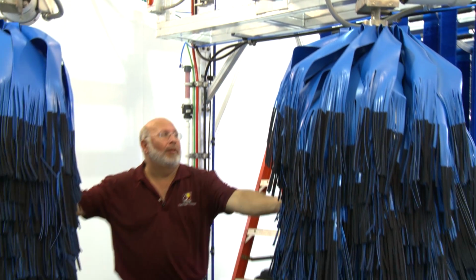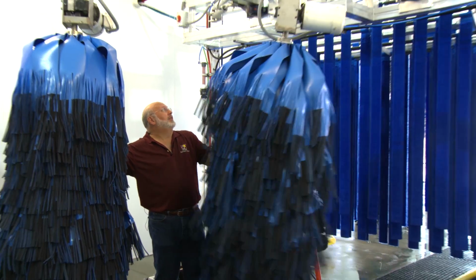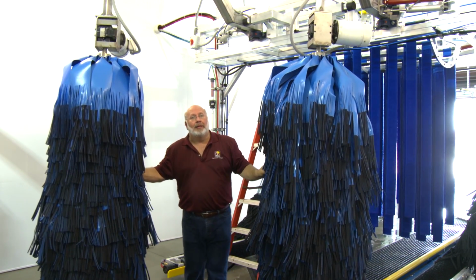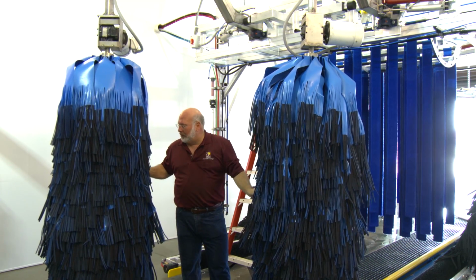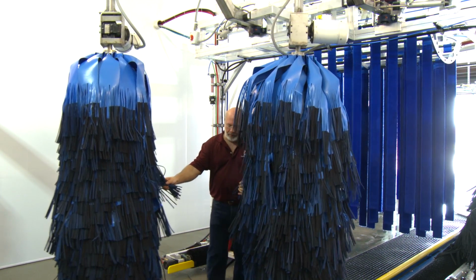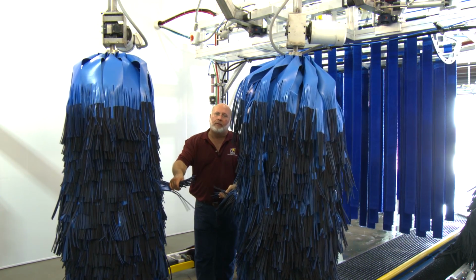They both do the same thing. The driver's side and the passenger side do the same. And you can also look up there and you can see that there are 3 hold positions. We set them off in the center holes whenever we ship them out. We do that because at that point, when they're in, we can see from here, we've got about 6 or 8 inches of overlap at the front of the vehicle.